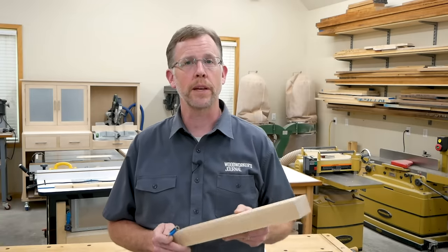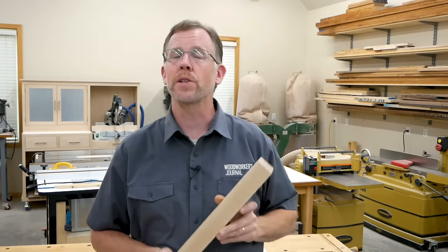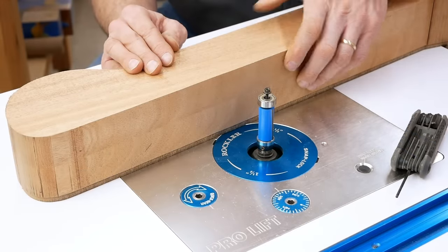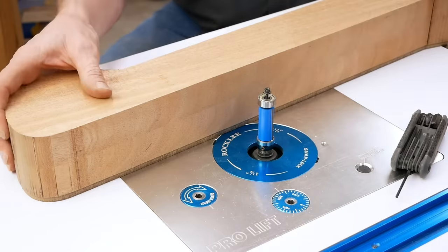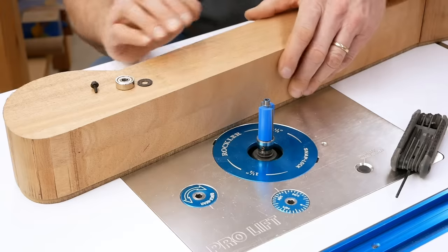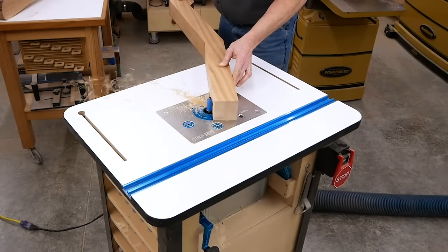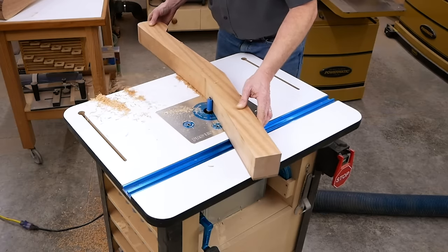Here's another tip when it comes to using templates. Sometimes the stock you need to cut is thicker than your longest pattern-cutting router bit. This happened to me recently when I was building a garden bench. You're going to need a long bit. This double-bearing flush trim bit from Rockler has an inch-and-a-half long cutting capacity. With the bit raised all the way up so the bottom bearing contacts the template on the bottom of the leg workpiece, remove the top bearing and washer — now this bit effectively becomes a pattern bit. Trim off as much waste as the bit will reach, feeding the blank counter-clockwise.